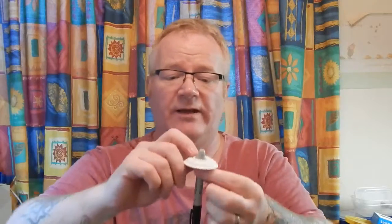Oh well. So what I was thinking was, as an example, a ring like that around it with some weight on it, and the servo lifts it up and drops it down. There'd have to be some sort of weight on top, so I've got to figure out whether to glue weights on it or use a spring, so that the servo will push it up but the spring will push it down. But I don't want too much force because it will ruin the tip and make the track too thick.